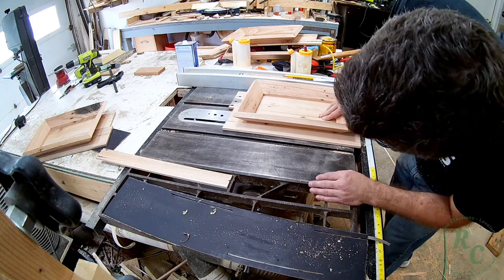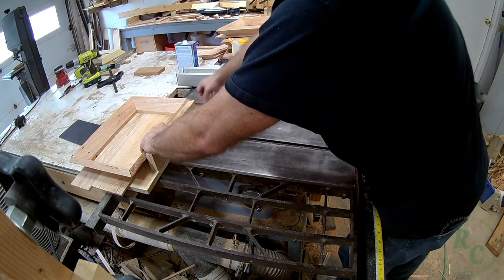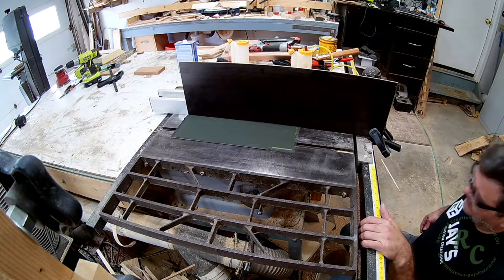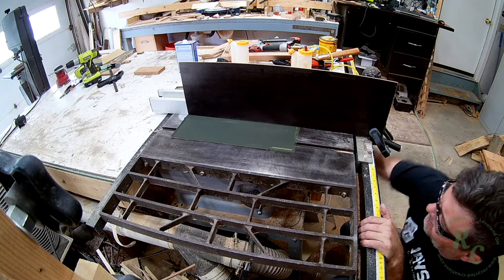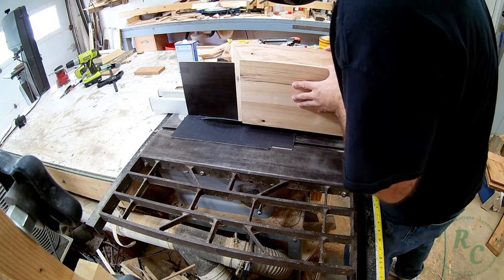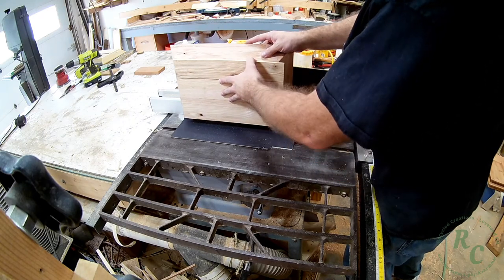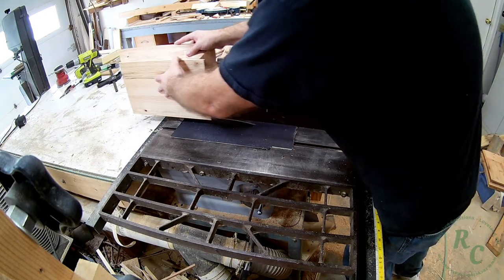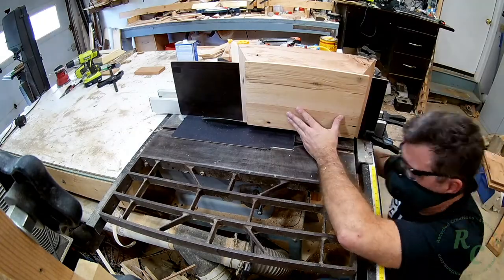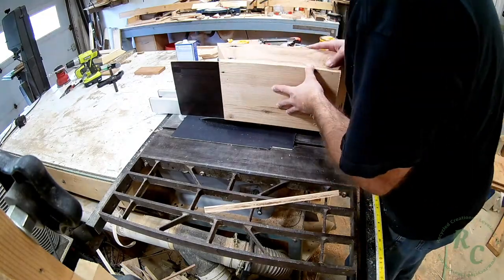Here I'm just using my fence and miter gauge to trim off the excess that hangs over the side. You probably saw this zero-clearance and extended fence configuration in an earlier shot — I was building the prototype ahead of time and already had this set up. This is another fairly intermediate cut. I've set the blade at a 45-degree angle and the fence so that the blade will skim just along the side and flush-trim the bottom with the side. I'm also sneaking up on the blade height because I don't want that blade protruding any further through the bottom than I have to.